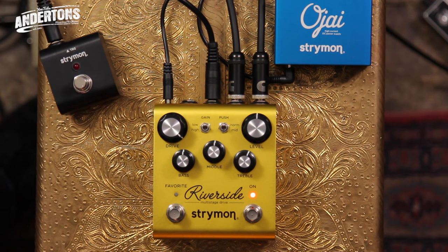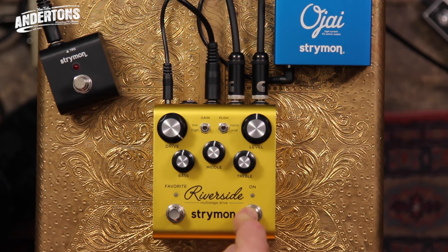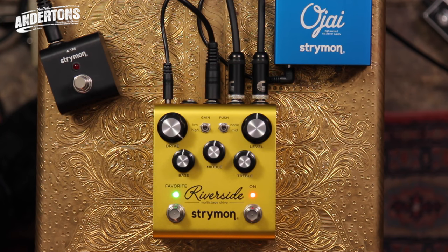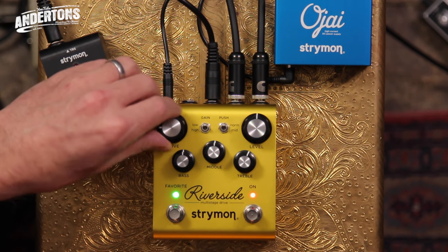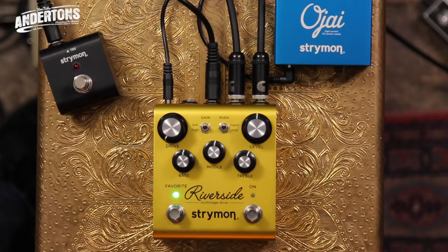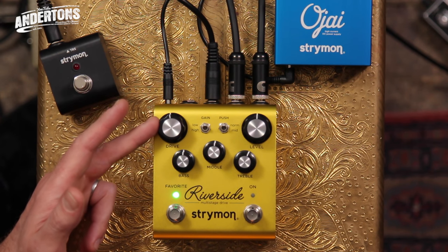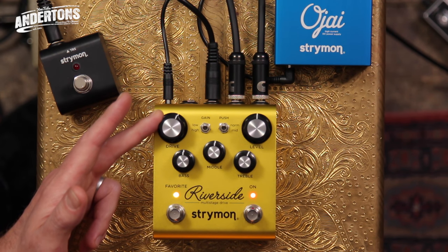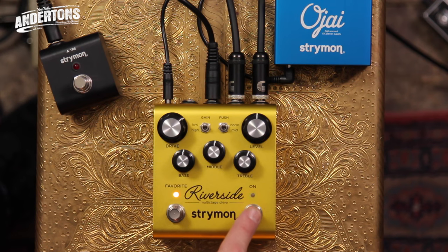To adjust the noise gate, I hold down the on and off button until everything starts flashing. Now the level control was the one that did the boost. That's what I had to adjust to see whether it was 6 dB or not. And the drive control does the noise gate. Multifunctioning. So if we turn your volume up, okay, there it is. I need to turn the drive control up until, okay, there it is. Happy with that. Yep. And then I just switch it off, and that.